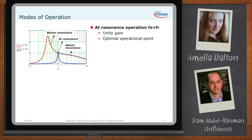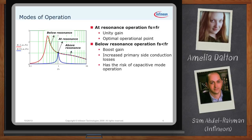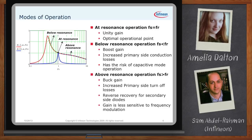Since the input voltage has a range that can go up and down beyond nominal, the converter's tank must operate in a boost gain or a buck gain. For boost gain, you go to the left of the resonant point at a lower switching frequency. For a gain less than one — a buck gain — the switching frequency must increase higher and higher. Each of these points involves different operating modes, different waveforms, and different losses.